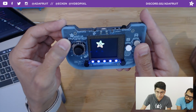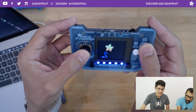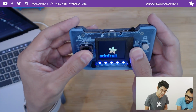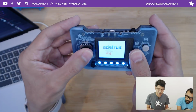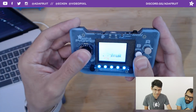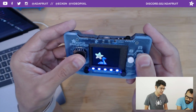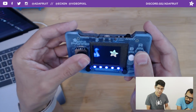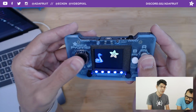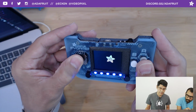Get a custom sprite. And how do you get custom sprites? Well, John Park, again, has a learn guide on how to polish MakeCode games. There's this thing called the PXT Asset Tool. It's on GitHub. It's a free project. And you basically drag and drop PNG files, and it'll convert that into all the little ASCII characters that you can paste into the JavaScript tab of your MakeCode project. So you can create image assets much better this way. I wouldn't have been able to do it without that asset tool. So that's the tip there.